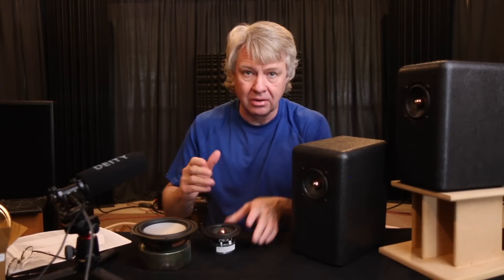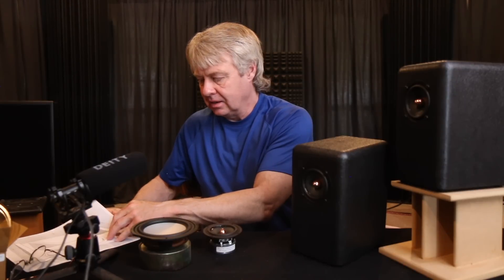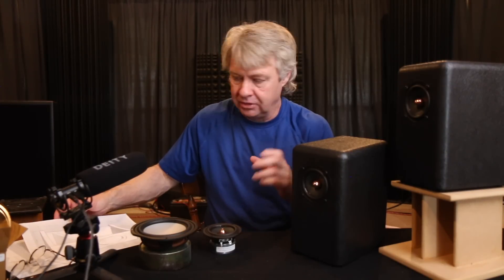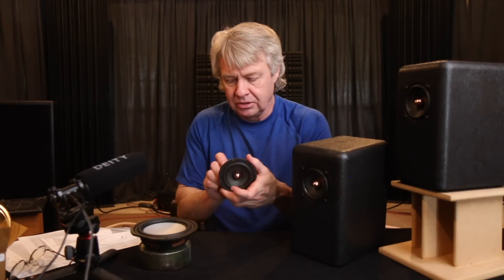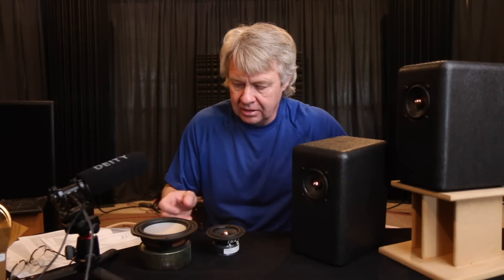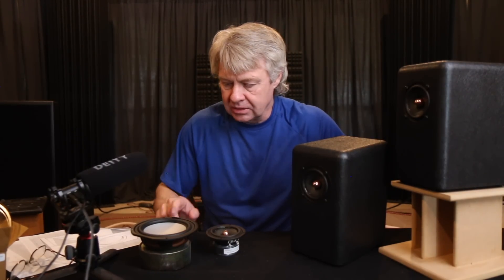We've had it on the drawing board for a while. We just haven't had time to get some of the cabinets knocked out. There's a little drawing here of the cabinets — we're going to throw it up as a little file for you to see online so you can get a better view of it. It puts the LGK in a little sealed box in its own airspace up top, with a little diagonal brace separating it from the woofer. The woofer needs a little more airspace, but we're going to do it in a sealed box too. We're going to try to keep this as small as possible and keep the cost as low as possible.